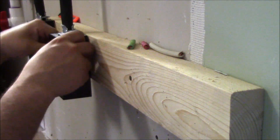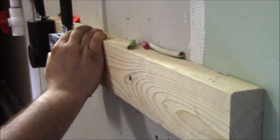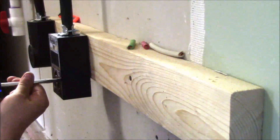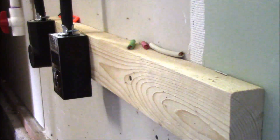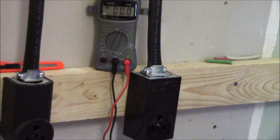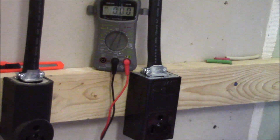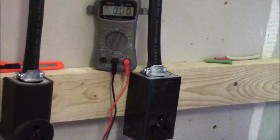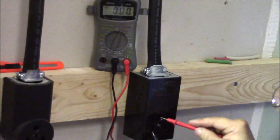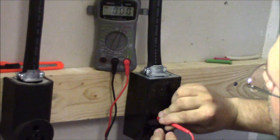The final step — simply put the cover on. The first good sign is always when you can turn the breaker on and it doesn't automatically trip out on you. Take your individual lead — since this is 220, anything from one hot to ground should show about 120 volts.